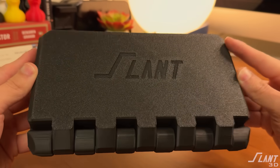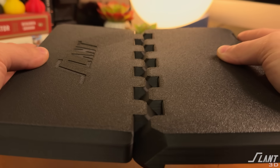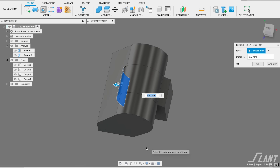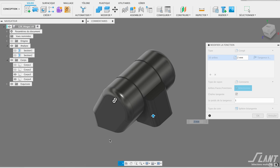If you just have a central hinge it'll tear out through the layers. There are ways of dealing with that, which we'll get to in another couple of hinges, but when doing this sort of hinge you want to print it effectively horizontally. We've done demos of enclosures and boxes that use this style of hinge — there's a lot of leeway with it. The biggest thing is to just make sure it's chunky, because if you make it really small and petite you end up with the outer loops breaking off.